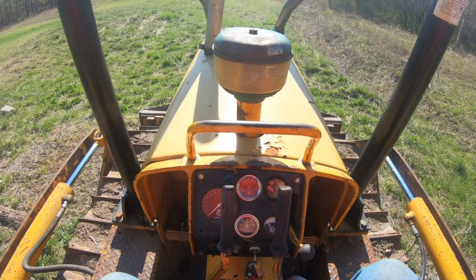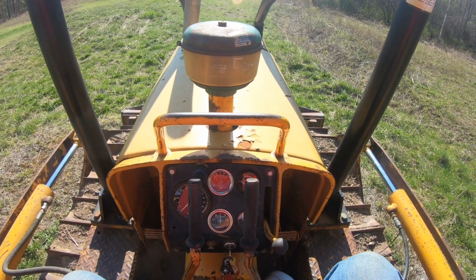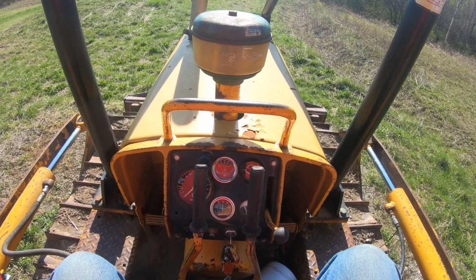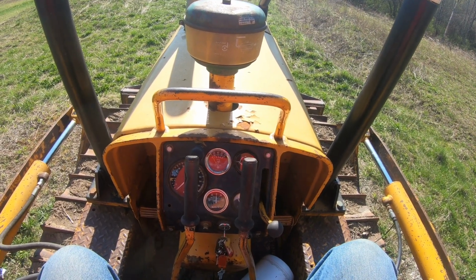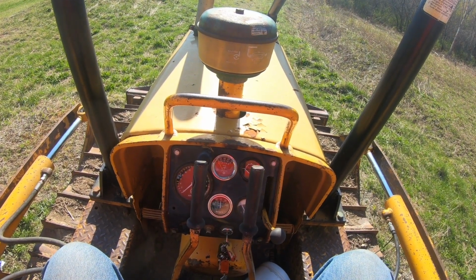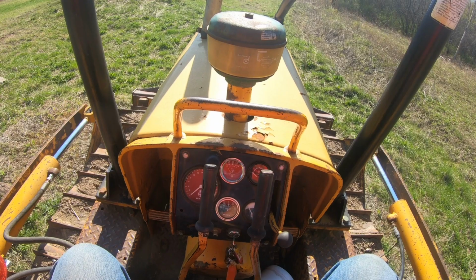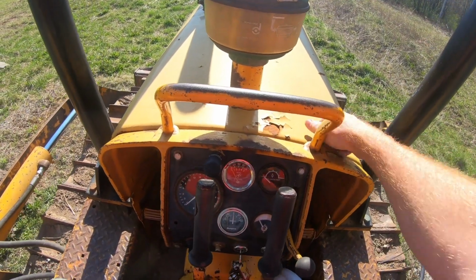I love Frank. This is really a cool bulldozer. The whole 450B still running. We've done some work to it. They're not wet clutches, steering clutches, so we've redone the clutches. Actually, I did them a couple times. Put some new hoses on it. Put a new hydraulic pump in it. Great knock on metal.